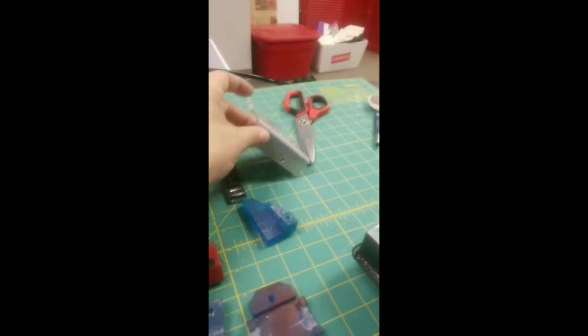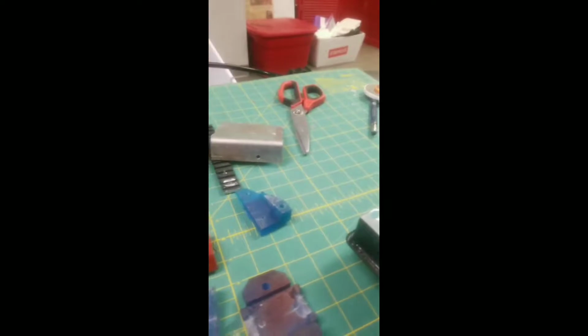Looking good, looking good. Some big changes in this little bracket here, aesthetically, strength-wise. You can kind of see in the back how crudely everything starts before it becomes. The way this works is I'm going to cure these, and we're going to use these to cast in rubber and then start pouring plastic parts, because I'm going to make an assumption that these are my final versions. We'll see.